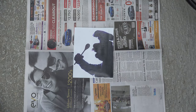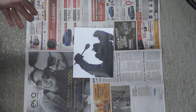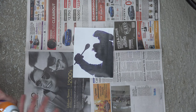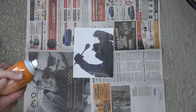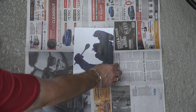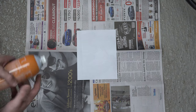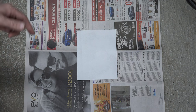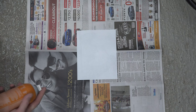So my 3/8 inch thick maple boards are 7 inches wide. So I've trimmed this picture up so that it's 7 inches wide. It's not rocket science. That's the only amount of board that I have. But what I'm going to do now in order to make a template here is I'm going to flip this over, and I've got some spray adhesive, and I'm going to give it a generous coating on the back of this, let it tack up for 3 minutes, and then I'm going to rub it down to a piece of quarter inch hardboard and then cut it out on the scroll saw.